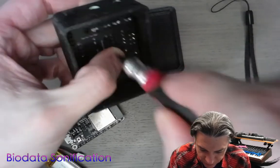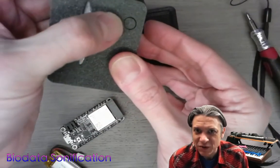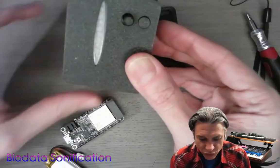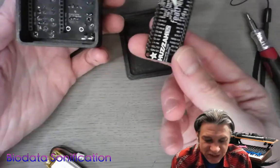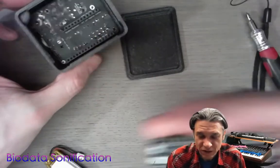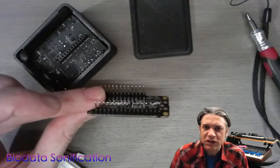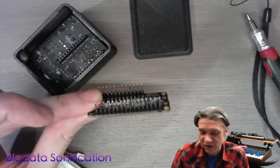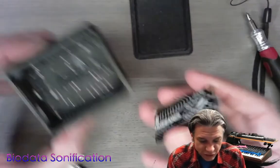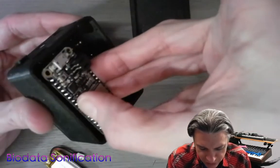The board's definitely not wiggling anywhere. It feels nice and good in place. I can press the button — it clicks smoothly. I can turn the potentiometer, and now I can also press the potentiometer down a little bit, since we pulled it up earlier in order to have it set in place. Now the last thing we need to do is take our ESP32 board and insert it. I'm using short headers here on the biodata board, but these are standard long headers on the ESP32. You can either trim off these headers, buy short headers and solder them on, or you'll see the tolerances are pretty good and you can even use the long headers.